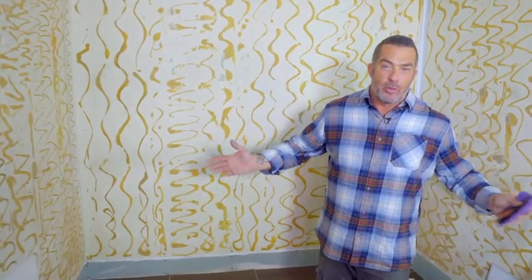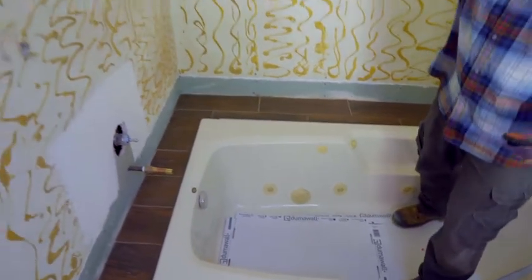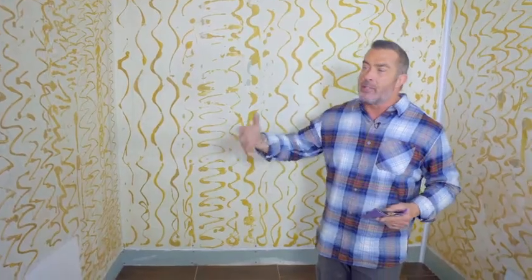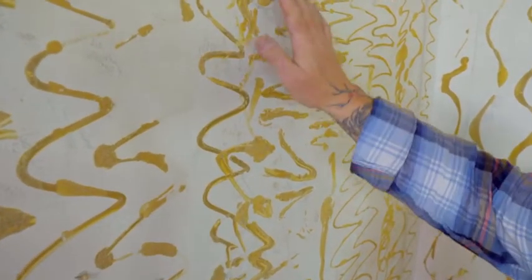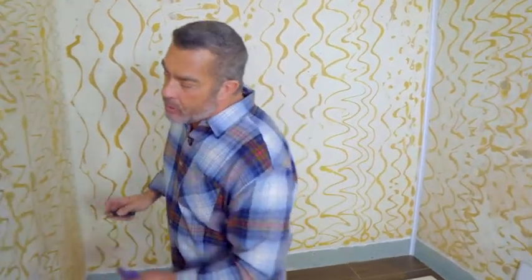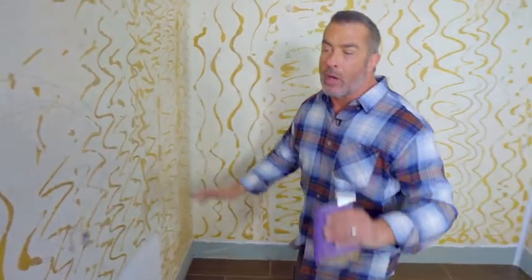I'm here inside of a tub surround. Even though it doesn't look like a typical tub surround, we have a tub on a raised platform and three walls that make the tub enclosure. The beauty of the DumaWall tiles is that they're so versatile and can be adhered over many different substrates. As you can see on these walls, there's still some residual glue from the old wood paneling after it was removed. Like any substrate we're going to glue the DumaWall panels to, it's important that the walls are smooth, dry, clean, and dust free. We gave the glue a light scraping, a little bit of sanding, and wiped them down — now we have nice smooth flat walls and we're ready to start laying out and gluing our DumaWall tiles.